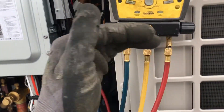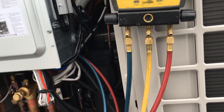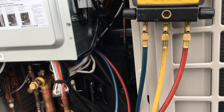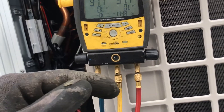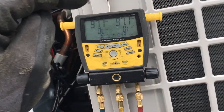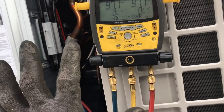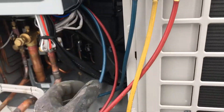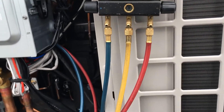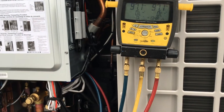Right now the preliminary test is good. I'll be testing at around 250 to 280 psi overnight for about eight hours, then I'll pump it up to about 450 psi overnight for another eight hours. Then on Monday I'll pump it up to 600 psi for 24 hours — only once it holds at 600 psi for 24 hours has it passed my bill of health. After that, I'll put it on the vacuum pump until it gets down to roughly below 100 microns.